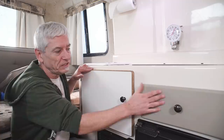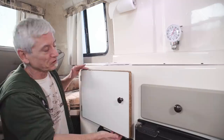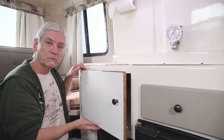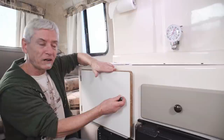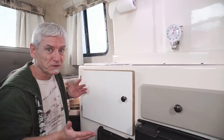The original drawers were MDF, and this is particle board. When you form and sand particle board it has these little air gaps which looks kind of grungy. What I did was take five-minute epoxy, put some on my finger, and rubbed it all around — then let it dry. It has a really neat texture and color. In order to make things not stand out too much, I thought of another idea.